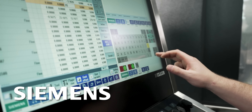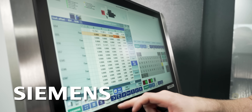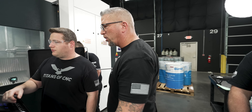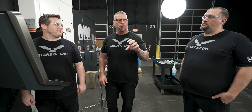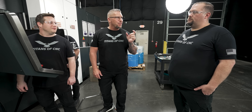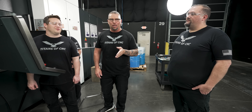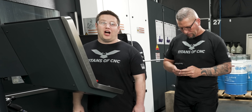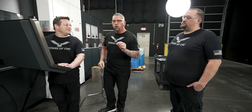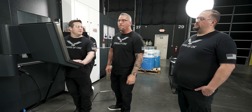All right, we're going up. You were at 650, so you have to go to 950. That's just a calculation on the machine that you've got to change. This is a three-quarter-inch tool at 500 inches per minute, and we're going 300 thousandths radial. That's getting close to half the diameter. That's a heavy cut right there. And then the MRR - 300 cubic inches per minute with a three-quarter-inch tool. That's insane.